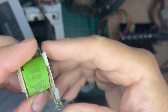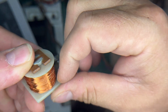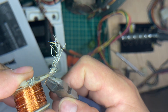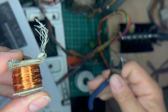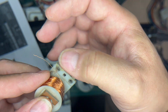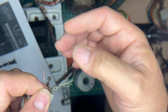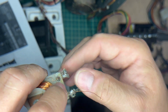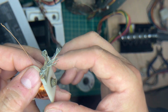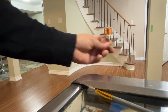So now, here's the donor. So take the wrapper off, and we're going to catch, okay, right here. Same thing. We're going to walk around the pillars. So you might be asking yourself, why does this work if these wires are all touching each other? Well, this gold or yellow is actually just a coating. So when you go to solder it onto the solder point here, you've got to scrape off the gold or red or whatever color it might be. This one I'm going to have to be a little bit more cautious on. I just have it resting on a drill bit. So here we go.